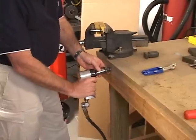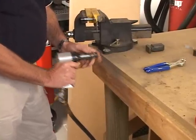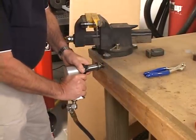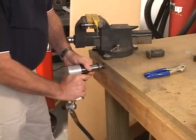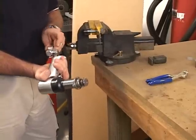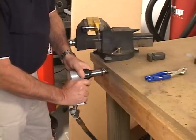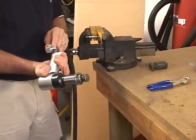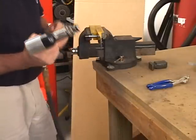I'm going to put this up against some wood here and push it — this is a very low air setting. You can see it's just kind of wimpy, not doing very much. I'm going to turn up the air a little bit more. That's a little better — I'll turn it up just a little bit more. That's about right. Now I'll show you what happens if you have too much air pressure — it's way too much and you can't control it. So we turn it back down, and you'll get a good feel for this. Now that feels pretty good — we're ready to rivet.